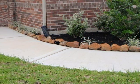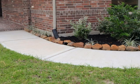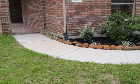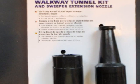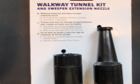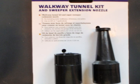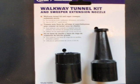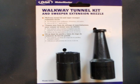One problem you may run into concerns concrete walks, patios, and driveways — we call this concrete flat work. This issue can be worked around in a couple of ways. If you have more than one hose bib, you can use two watering systems, one for each side of the flat work. Another approach is to use a special piece of hardware to create a tunnel under the flat work. Once you make a tunnel, insert a piece of PVC under the flat work and attach a hose connection to each end so you can attach soaker hoses to each end of the PVC. The ground under the flat work will not be watered, but the flat work concrete protects the ground underneath from being excessively dry or wet in any case.